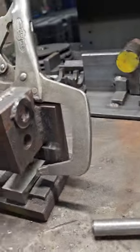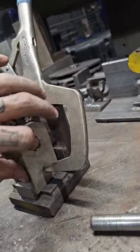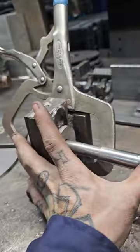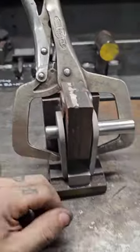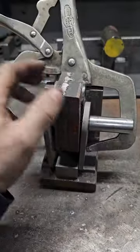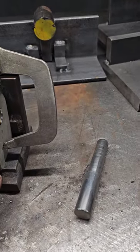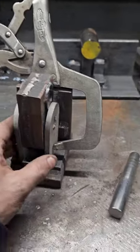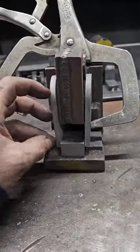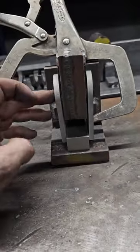This one is for all those stainless parts I was making. It goes in here and it's got holes in the side to line up the pin, then it gets clamped in the back. Flip it out once it's tacked, turn it around, clamp it back down, tack the other side — and it's all done.